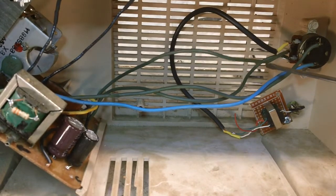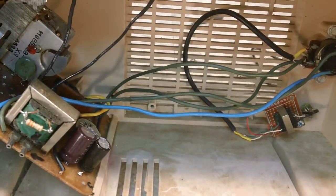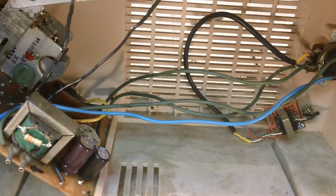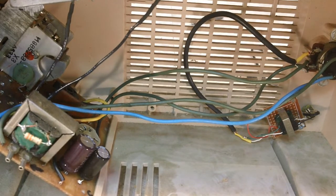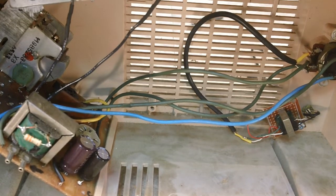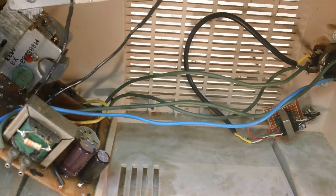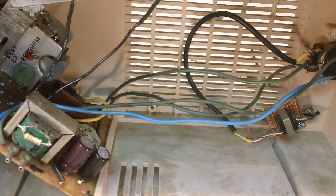So that's the wiper there. That goes to... well, let's see, where does it go? I think that's the one that goes to the 50C5. No, it goes to the 12AV6. It's the first audio stage. That's what it is. And I do have to put the tubes in, but that's really all I have left to do besides put the back on.